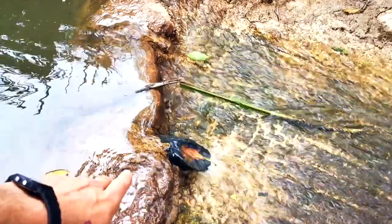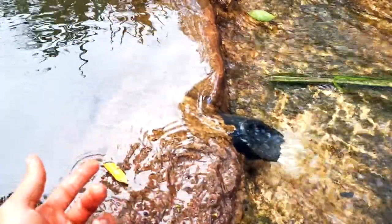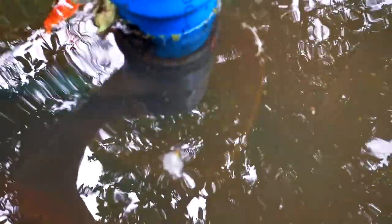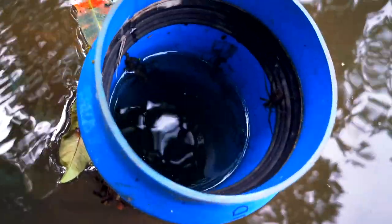So this is our low patch that we put in. The first bit of water would move through this pipe over here. There we go — and then when that gets saturated it moves down over this, and when it really gets overfull it's going to come over the rest of the wall. Underneath there, down here, there's about a 25-litre drum with a bunch of holes drilled in it, and it goes around a pipe that comes up into a T. From that T it goes into a 4-inch or 100 mil pipe that comes through our wall as our primary water intake for the ram. This is a pretty good filter — not very much goes in there except for the odd spider.